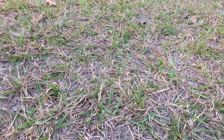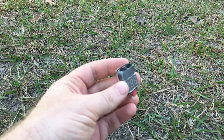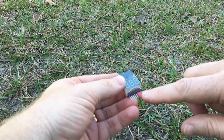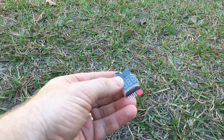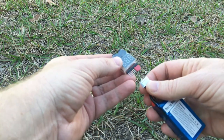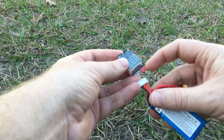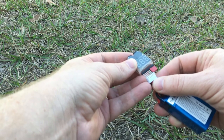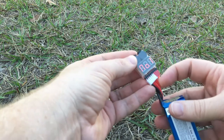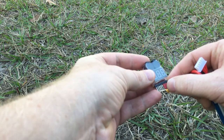The first tip for today is centered around this guy — you've all seen these before and I suspect we've all got these in our bags. The difference about this one is I've added this little bit of red heat shrink here, so that we know the orientation of the battery balance lead. The red of the balance lead matches the red of the heat shrink, and there are only five pins exposed so we know we can connect it in this manner. This one is configured for 4S.